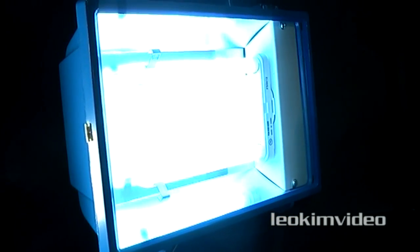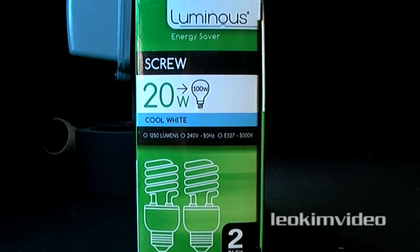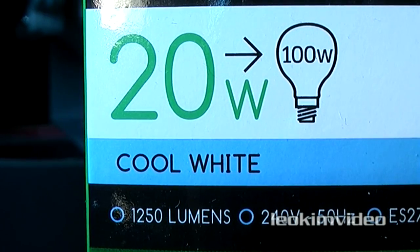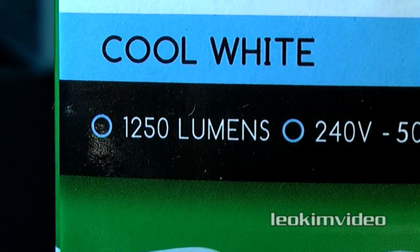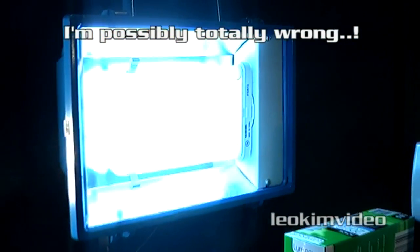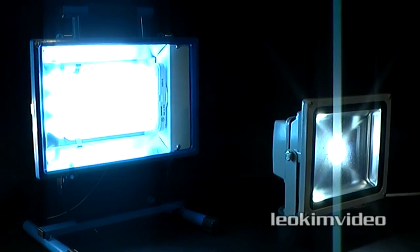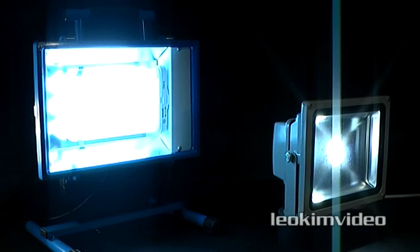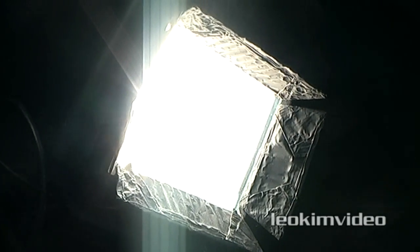Maybe there's a clue by looking somewhere else — by looking at this compact fluorescent bulb packaging, I can see how many lumens per watt there are with these types of fluoros. It's telling me it's a 20-watt bulb, equivalent to a 100-watt tungsten, and it's got 1,250 lumens. So from that deduction, I could probably say that's about 2,800 lumens coming from that fluorescent work light — but that's only a rough guesstimate. It really did seem that the fluorescent and the LED were putting out sort of the same amount of light. And it's really hard to find the lumens for these halogen lights unless you look at the fine print on the bulbs, where it's almost hidden away.